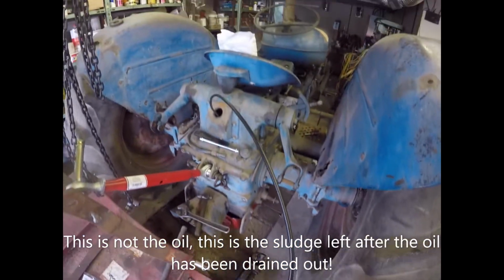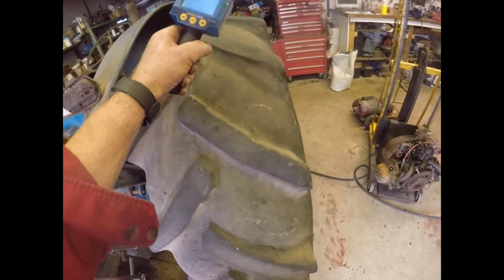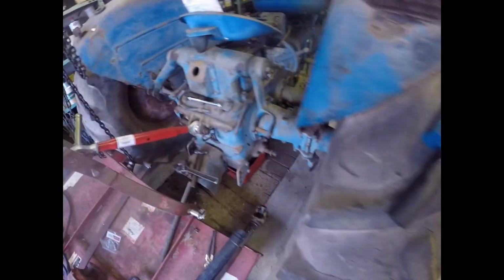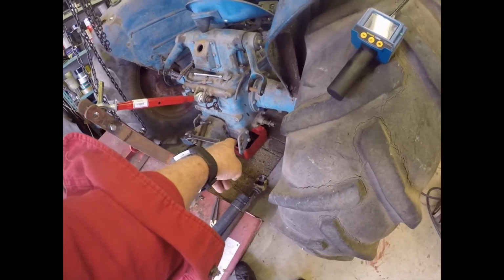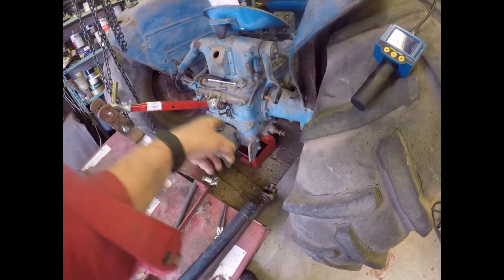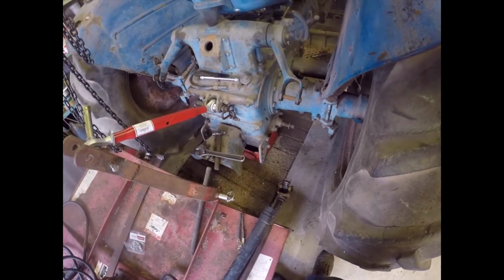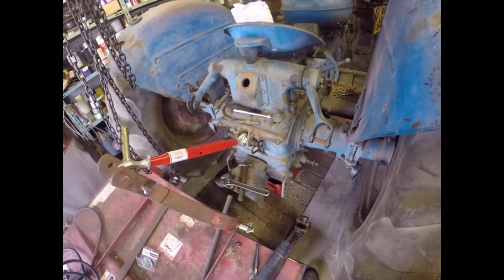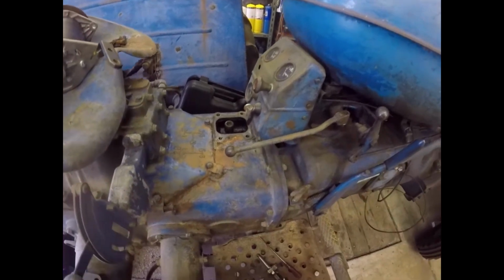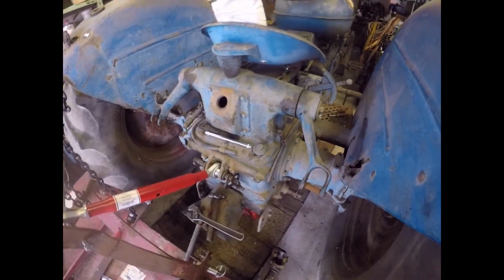And then, I'm going to get some... I'll take that out now if I get it covered in oil. Too late. I'm going to get some Kero, which I've got over there in that can. And I'm going to probably put the bottom plate back on. And I might just empty that oil tank out. Rig up some sort of Hessian filter over it or something like that. Get one of my air pressure sprays, and start to spray Kero in there, and in the gearbox end as well, in the gear stick end, because I've got the gear stick off there, and we can wash it from both ends, and I'll see how it goes, because we've got nothing to lose.